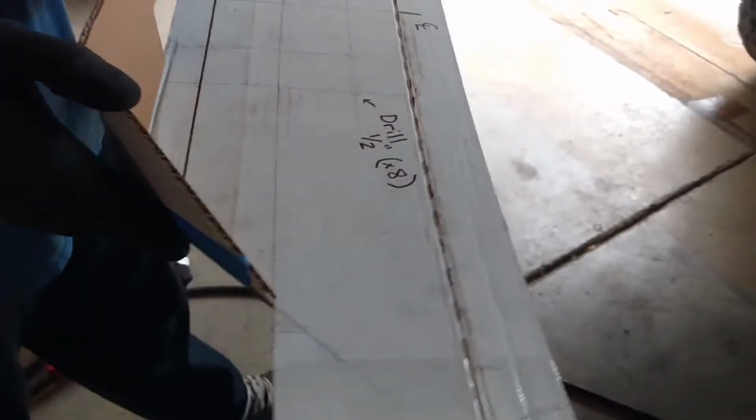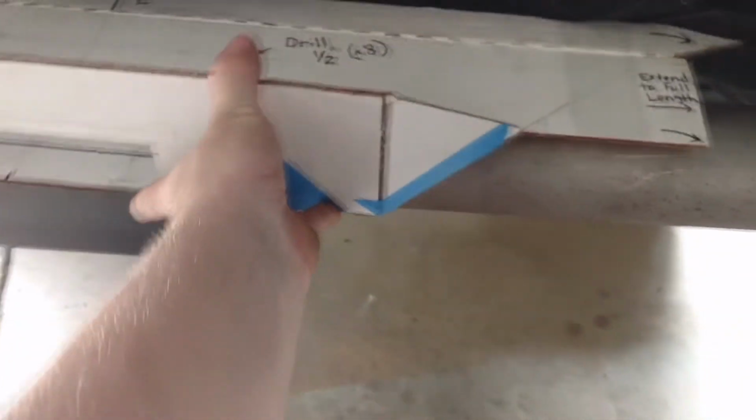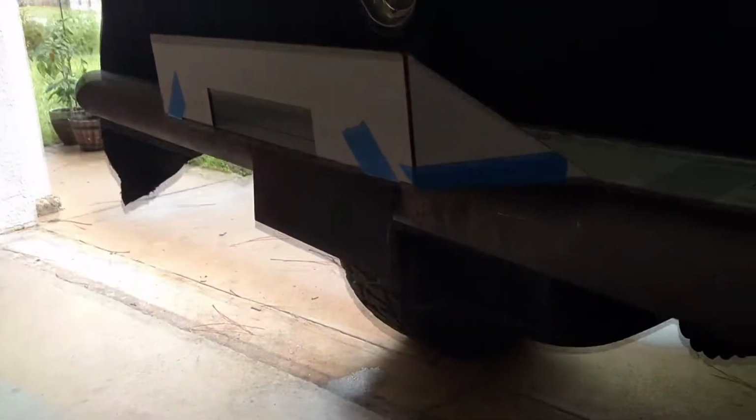And the next thing we built was a template out of some corrugated cardboard. The blankets are kind of in the way, but when you get it centered up on here, he has room that he could fill in and weld down there. Got room to mount a full-size winch on it. We already checked. There should be clearance kind of in this area to get the upper bolt holes mounted.